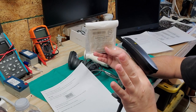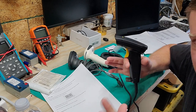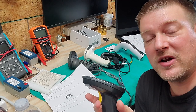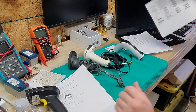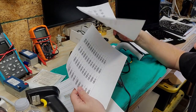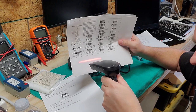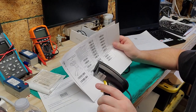You heard two beeps there — one beep registered that it found a barcode, and the second means it has nowhere to send it because my laptop is still off. The beeps on a barcode scanner tell you a lot. A beep registers according to the barcode library, which you can create by registering your device with a barcode programming library. The programming library contains specifics for your model or manufacturer type of barcode scanner.